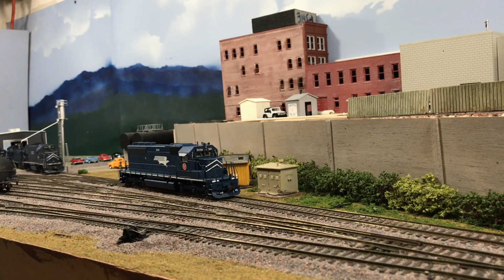Now let's talk about lights for a little bit. With the Tsunami2, we've advanced the lighting features quite a bit that allows you to faithfully reproduce the different lights. We call them hyperlights, but these are things like Mars lights, gyro lights, rotary beacons, all kinds of things like that. But some of the new features that we've built into the decoder is constant dim, and you can have two brilliances. You can have a constant dim 1, constant dim 2, and you can even adjust the brilliance of these by using a CV.